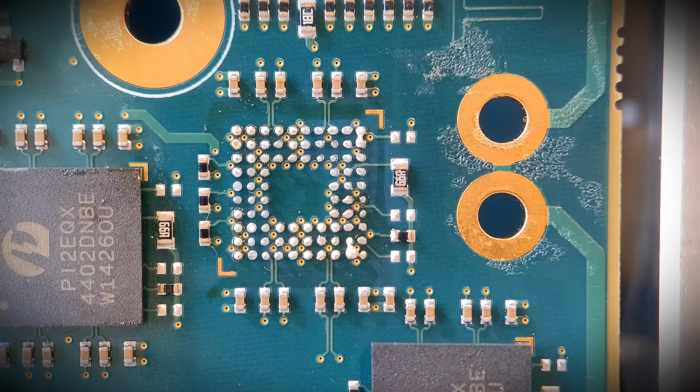As you can see, that one took a long time because of the makeup of the board, and yet nothing's become dislodged around it. So yeah, if you're taking components off like this, get yourself some aluminium foil. The advanced one's really good, it's not too dear, widely available online, and it's because of the adhesive line, it's really going to help. And the adhesive comes off really easy just with general PCB cleaner.